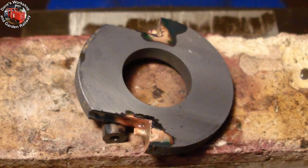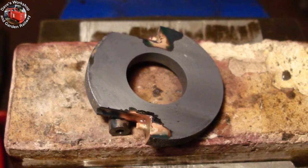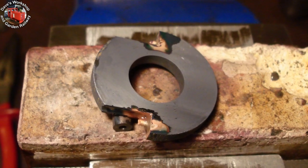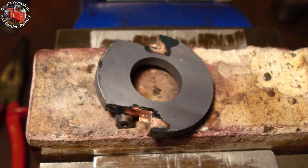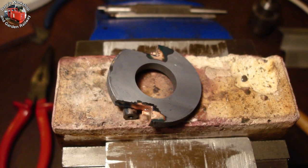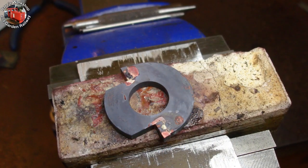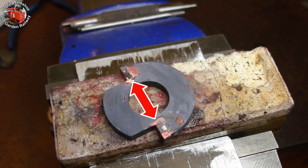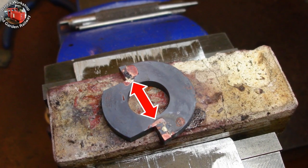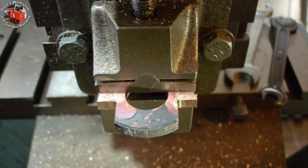It's time to repair the first eccentric strap. The drilled holes were plugged with pieces of 1/16th brass rod and silver brazed in. Gunmetal always goes this colour after heating to red heat. The job is cooling down before its bath in citric acid. Next, skim the faces for the one eighth pads. Cooling down after the pads have been brazed — it's important that there is enough silver braze on the inner ends, as there'll be no lower support after slitting. There we are, back to square one: the first eccentric strap is ready to proceed again.